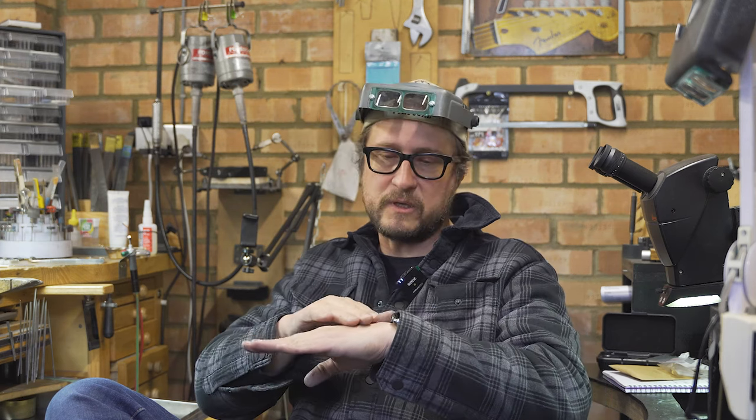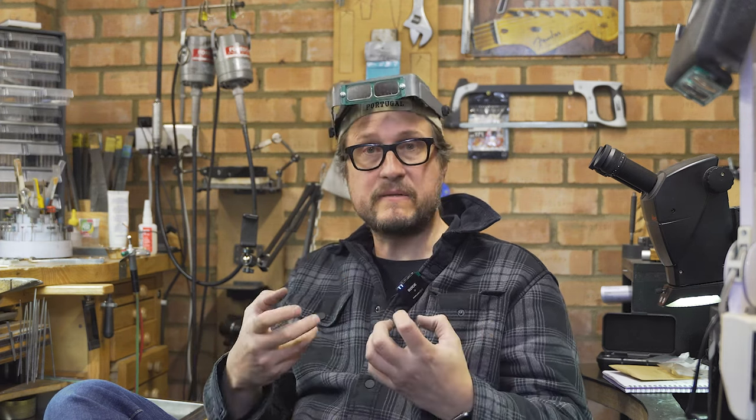This is why we do the pre-polish with the 3000 paper — once you've finished it's an incredibly neat finish. Before the solder I'm now treating the piece with the stipple finish with the same regard as I do for the corners and design finish, so everything is protected. Even though the back isn't covered with boracic powder, I again paint a thick paste of it on the front area so that the heat doesn't affect the color or the work I've done on the front of the cufflinks.